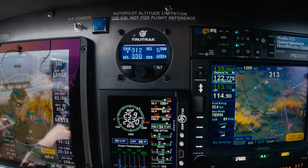We're at 6,300 climbing to 7,500, and I'm going to activate GPSS mode. The autopilot source select switch is switched over to the Avidyne 540, so the TrueTrack will receive GPSS roll steering commands from the Avidyne. You can also hook up a handheld portable to the TrueTrack, but it won't do turn anticipation, procedure turns, or holds. With an IFR-certified GPS navigator like the IFD 540 connected via ARINC 429, the TrueTrack will fly anything drawn on the flight plan — procedure turns, holds, DME arcs. I press the mode button to go into GPSS mode, and it should turn to intercept the course.